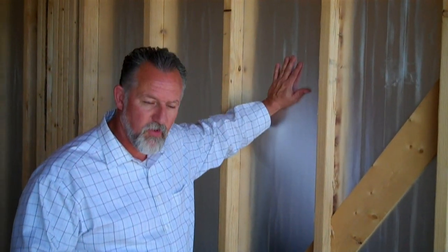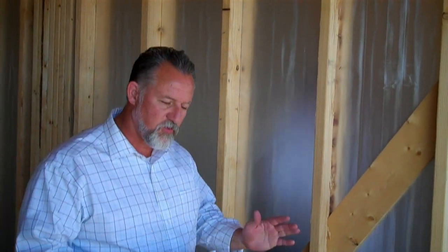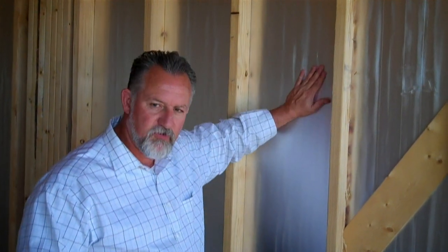It's not that the studs aren't going to fall down — it's going to take the wind and everything else. The other thing that's important about doing it this way: we didn't put wall sheathing on here, this is a foam board. This foam board is over top of all the wood, and it creates a thermal barrier so the cold doesn't come through the plywood, to the 2x4, into the drywall, into your house. You've got an actual thermal break in the house. When you're going to build a house, make sure you get thermal breaks put into your house.